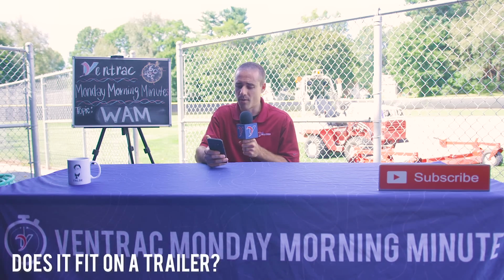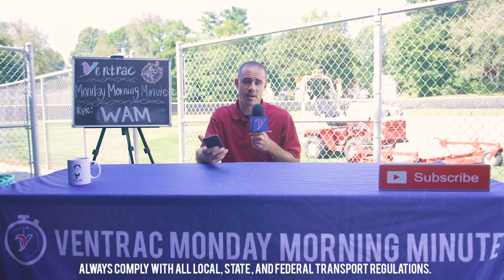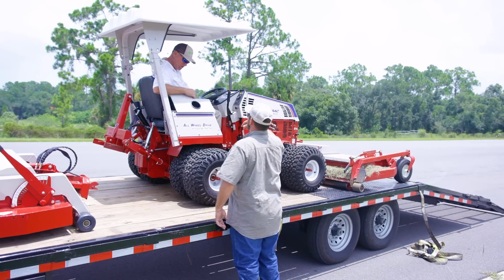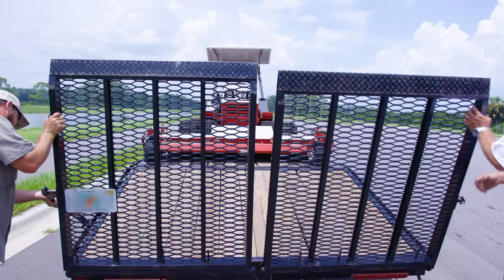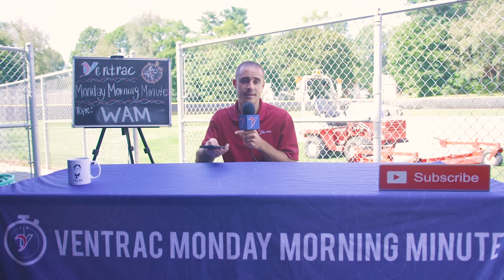Another question we got was, how am I going to fit the wide area mower on a trailer? You have three options there. What I do personally when we take it around places is I use a deck over trailer. That's your easiest option. The deck itself is 96 inches wide. So if you can, use a deck over trailer. That's the best solution. If you can't do that, you could use a 3-point with a 3-in-1 receiver and put the deck on the back of the tractor and lift it over the wheel wells.